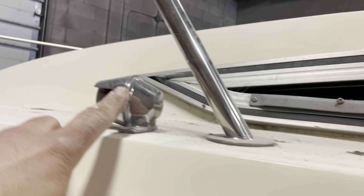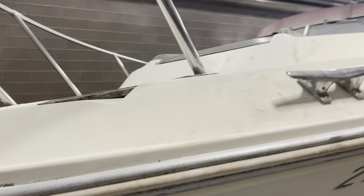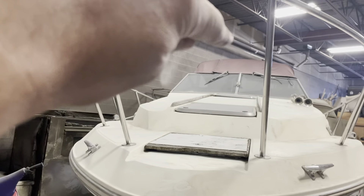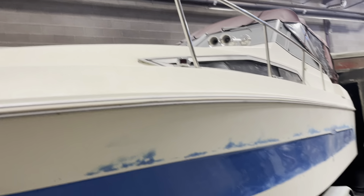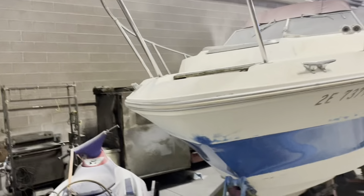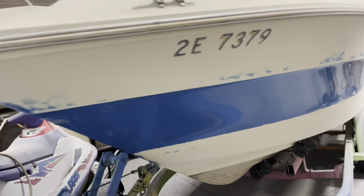I'm just going to go around the boat and start removing everything: the horn, the lights, more of these rope anchor cleats, the compartment lids, the wood up here — removing all those. Just doing all the detailed stuff. Then I'm going to clean it, finish sanding, clean it super well — wash the entire boat, followed by degreasing it, and doing a final wipe. Then I'm going to mask everything off and paint it. Let's see how it goes.